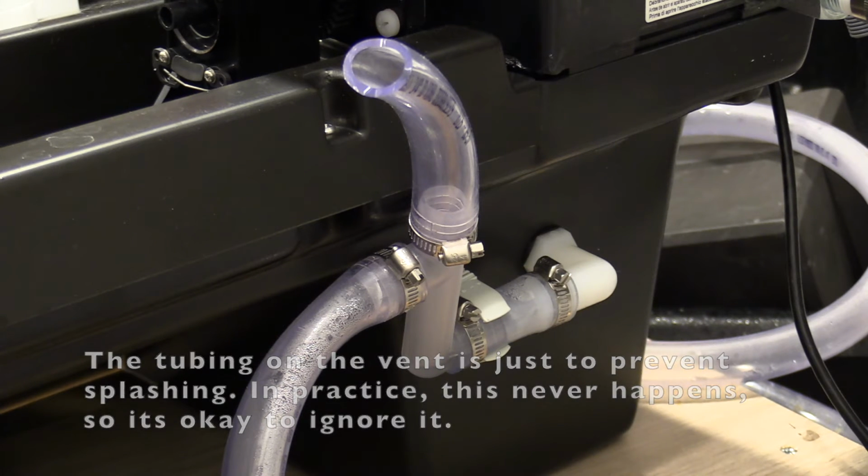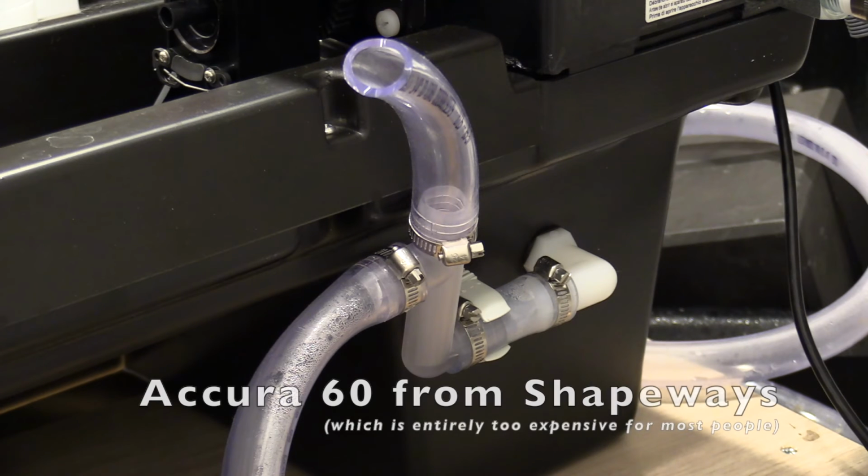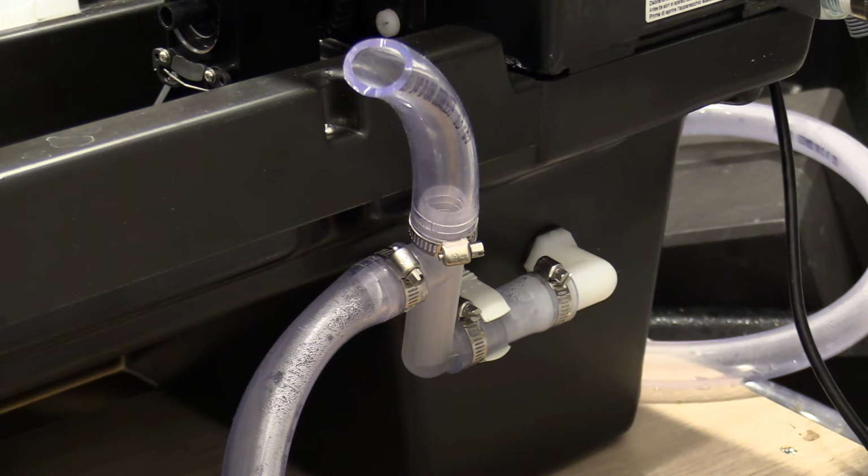I later went and got it professionally 3D printed out of a more watertight material just to make sure I'm not risking any drips on the back of the machine. Now the Jobo fills its lower trough right up to the 900 milliliter mark on the bottles. Of course, once the recirculation pump starts to fill the upper trough, you might still want to add another 6 liters of additional water to regain that level if it's important.